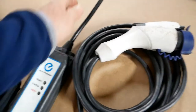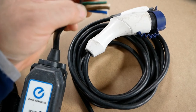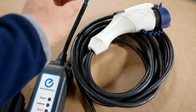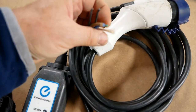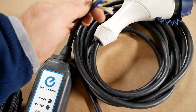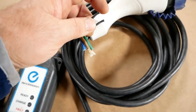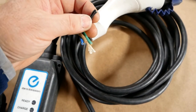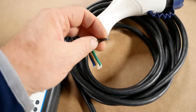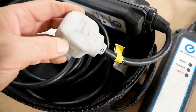When I got in there I discovered that you've got an extra two wires. So you've got your normal earth, live, and neutral, and there's some string in there which allows the cores to move and keeps the cable very flexible — but you've also got these extra two cores, which turned out to be a temperature sensor, I think on the live wire, which was very interesting.